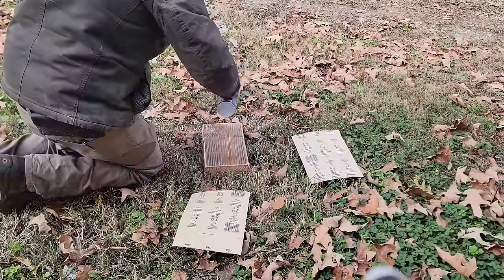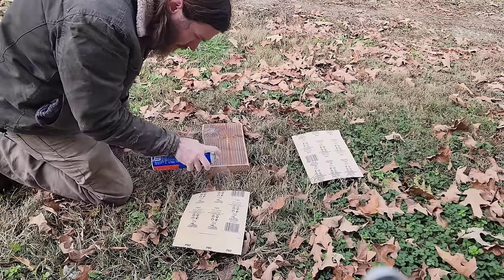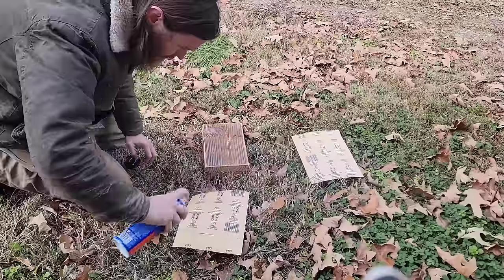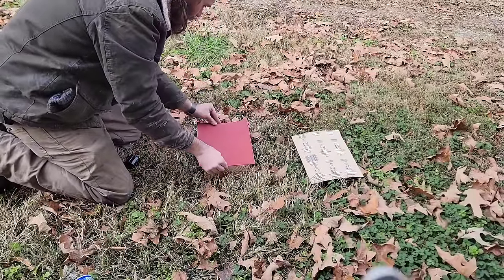So that wound up creating high spots where the resin was and low spots where the wood was, because the wood would just get sanded away so much faster than the resin. That was the one mistake that probably cost me the most time and pain trying to fix it.